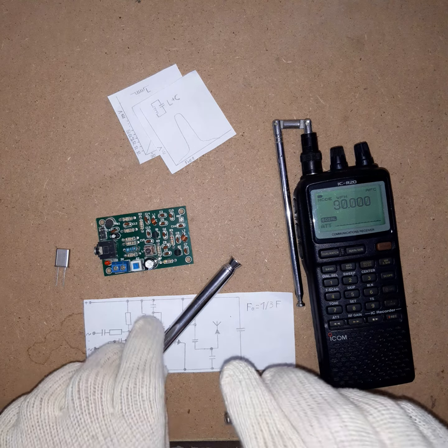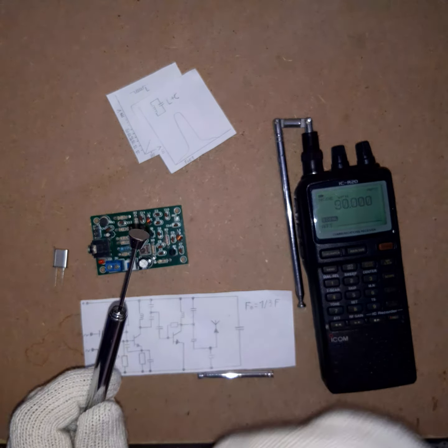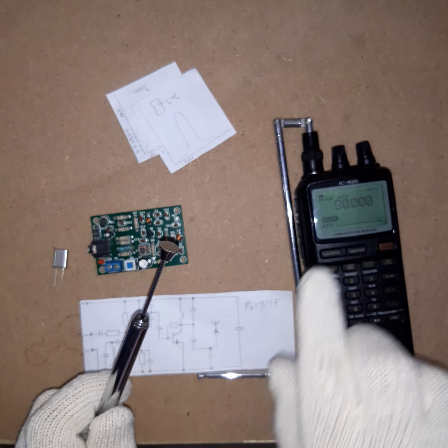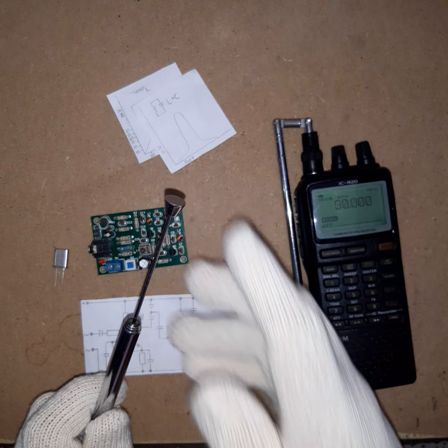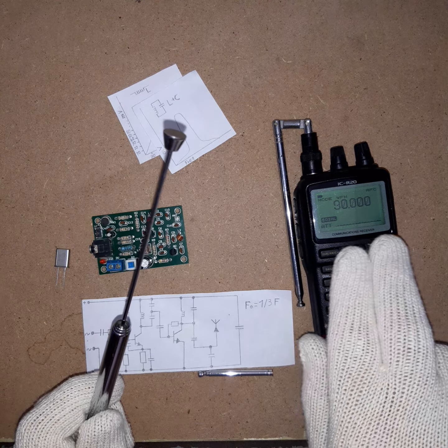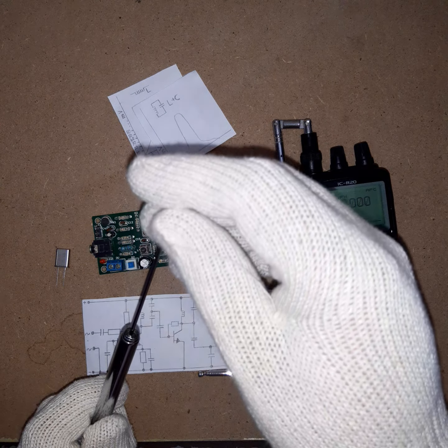And then I started to pull out the element of it, like so. Of course, it was far longer, but this is just an example. So I pull out the element, and on the meter I'm reading 7 bars. Then I pull it out a bit more, 9 bars. Oh, it's getting better. And pull it out even more, it went back to like 8 or 7 bars. So I defined a specific length of the antenna.